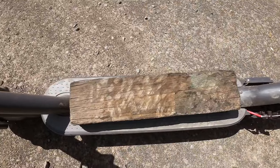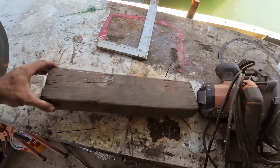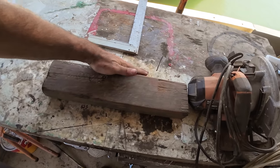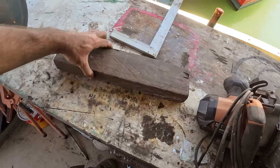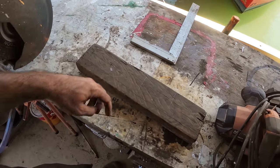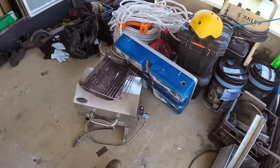I reckon that bit there will do the trick. As you can see, it's on the flat deck work truck. There we go, sand it up. So I've radiused all the edges as well so that it's easy to get the fiberglass around this, because we want to wrap some glass around it and so on. But I've also marked up 100mm blocks. So we'll get this cut up now and we'll start shaping it so that we can fit it into this guy over here.